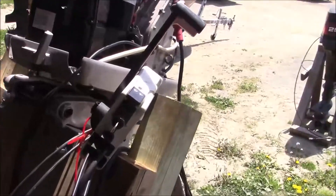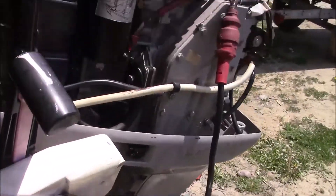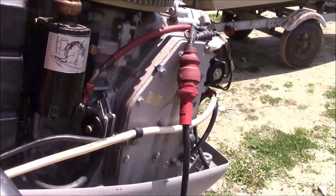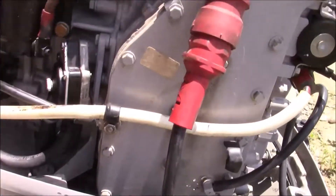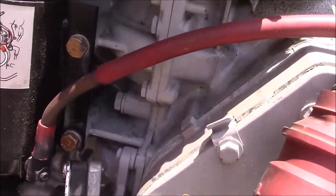Here's 2.0, and there are some rather significant differences between this one and the last one. This one has got a knock or a rattle on the inside which I can't identify - could be a wrist pin, could be a broken piston skirt, could be a rod bearing or something like that going. I don't know.